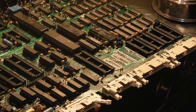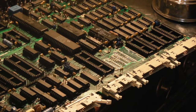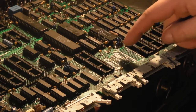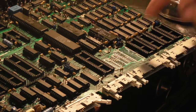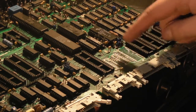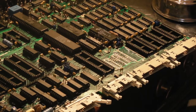I was pretty certain I actually had repaired all this, and it was correct. I had tested it all out. It's just I wasn't entirely happy with the way it looked, and I must admit I've been watching a few more of Gadget's videos, showing really it's better to rewire it on the back of the board, and I tend to agree with him, because yeah, it wasn't that visible because it was underneath an IC socket, but you could see the bits of wire and what have you. I think it would be far neater just to link it up on the back of the board. And actually, I've even got a bit of green paint just touching the solder mask, which I damaged down that side when I was being a bit over vigorous with some desolder braid to clean it up when I originally did pull that IC off.